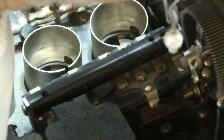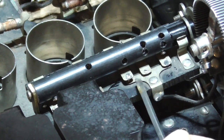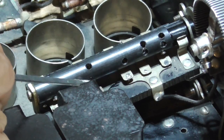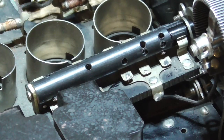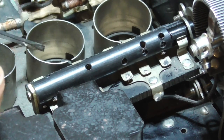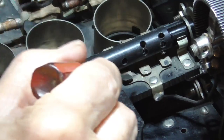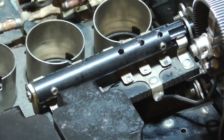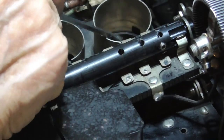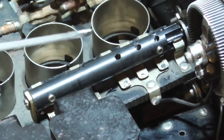And then if we go to two, we have one and two contacting, three is not, and number two is contacting, and one is not. So number one will feed through the transformer to the grid of two, and then the plate of two goes to the output. And one and two are both lit. And tube number three, we don't have, so it's not lit. And if we go to three, all three filaments are lit. That's one, two, three lit, and both of these are not touching.